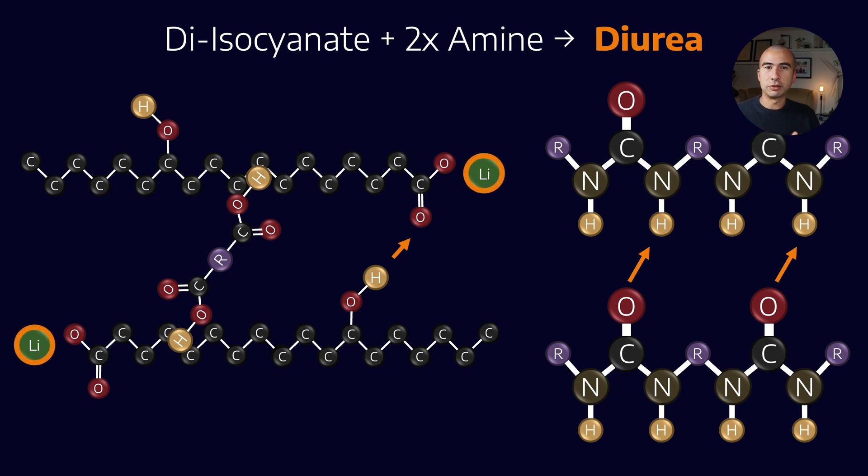We can also see more differences. The metal head is usually charged on a metal soap, which is what attracts it to water as a detergent would. Metals are known oxidation catalysts, and that's one of the great properties of a polyurea: because it contains no metal, it is highly oxidatively stable, and therefore you get very long lifetimes out of these greases.